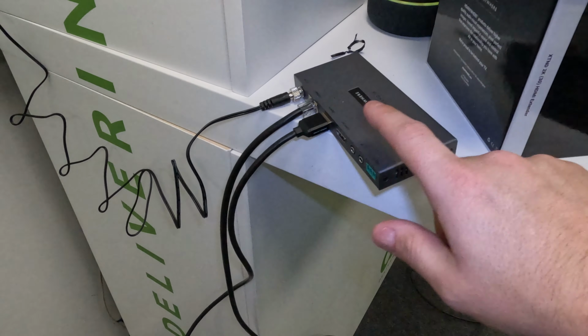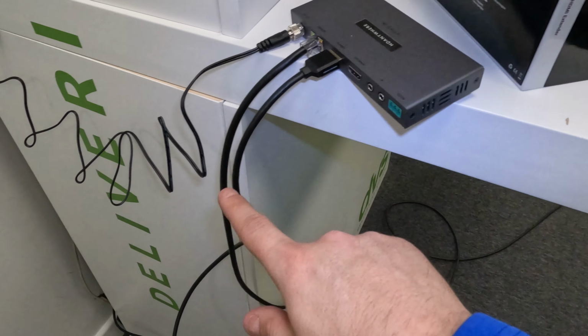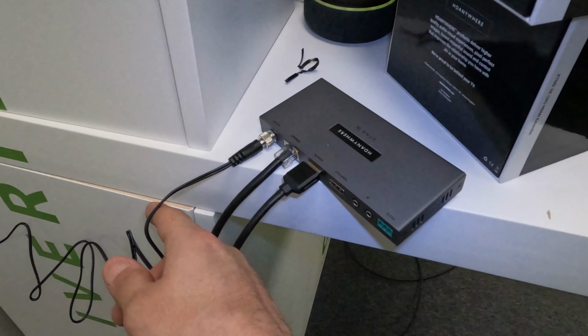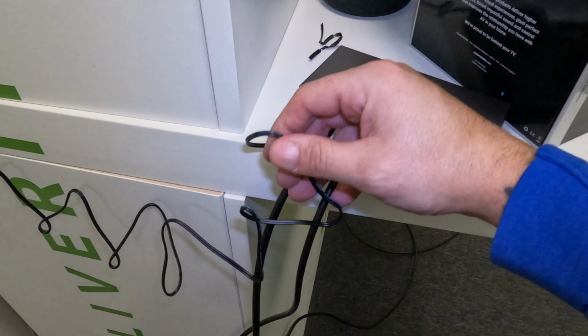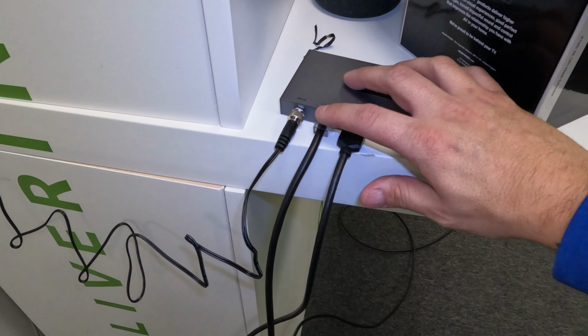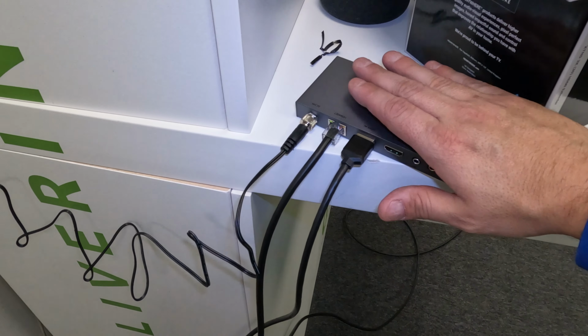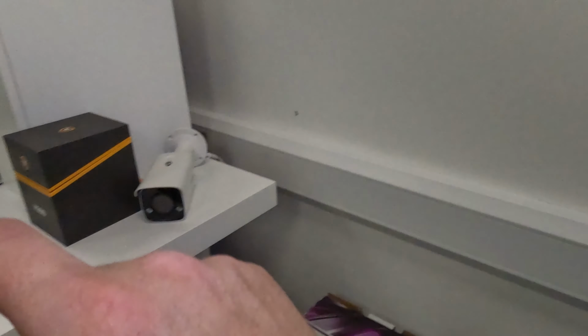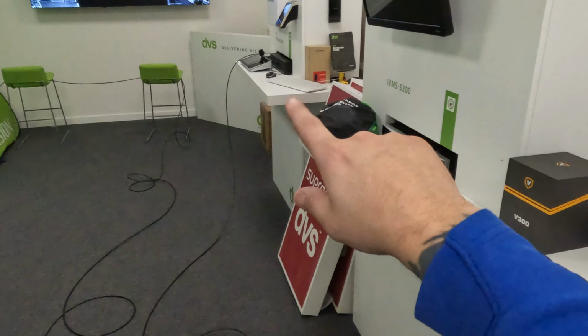So you can see, here's the HDMI extender, so you can see our HDMI cable going round to the back of the HDMI recorder. I'm not going to show you, that's boring. Now it is powered with the included 12 volt power supply. Now these are PoE effectively, so we power the transmitter end where there's power because the recorder's there, and that actually powers over the Cat 6 to the screen end down that end. So there's only one power supply needed.